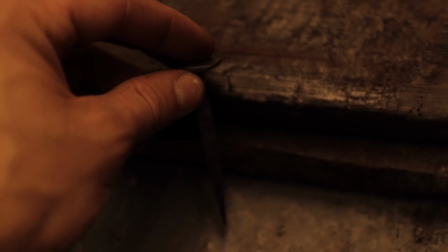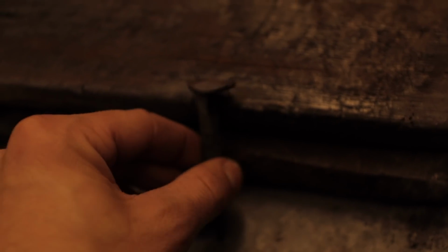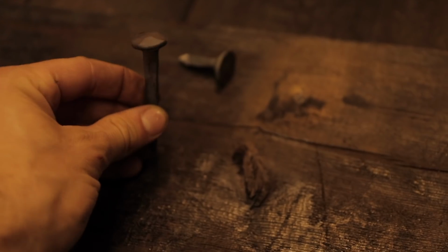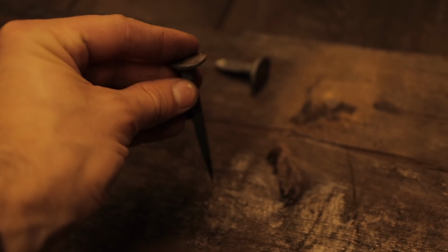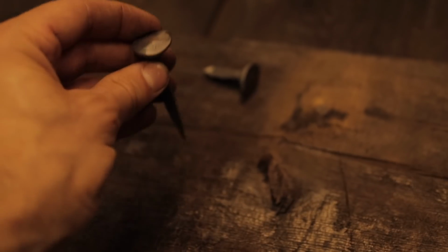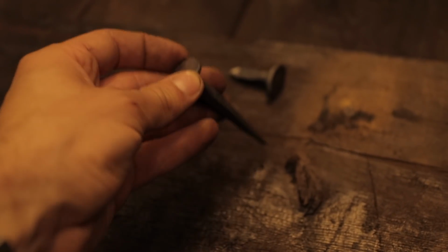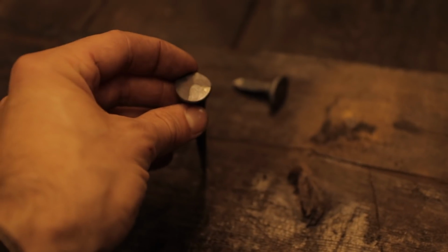So what we're going to do is use these size nails in the wood itself, and hammer them home, hammer them through, and they're still going to stick out quite a bit. But it doesn't matter, because then we're going to hacksaw the edge off. At least that way it pinches in and holds in the wood rather than spreading the wood too far. The thing is that this is soft pine, so we've got to be careful punching through. These sorts of nails on something like oak would pinch in no problem, it's such a dense wood, but the grain in pine is not so dense, it could split really easily, and it's reclaimed wood, remember, so it's potentially going to split, so we have to be really careful when we drive these home.